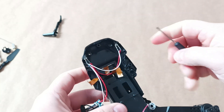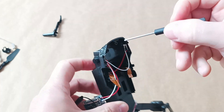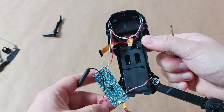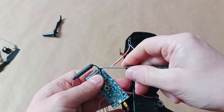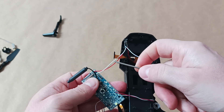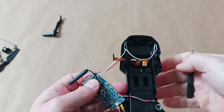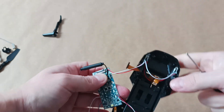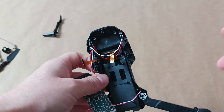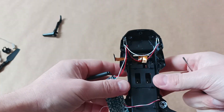Another thing that could be affected by water are the connections to LEDs. The LED lamps may stop working. One of the things you could do is not to unsolder these cables, but just cut them and connect them here using very little insulation so that the drone can fly later. If you put too much tape, the drone may not fly up because it cannot carry too much weight, and even a few grams may affect how the drone flies.